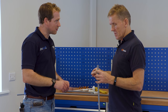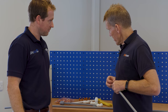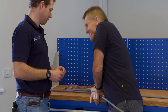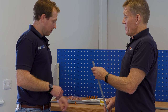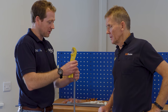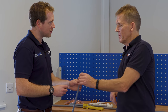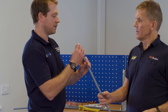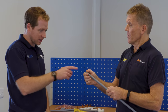Supposing I did use some cutters and I made the pipe oval — what do I do then? Well, the first thing you'd do is insert the liner into the pipe. What I'm saying is — for some reason that's happened to the end of my pipe. Well, ideally I would cut slightly further down the pipe and remake the cut, put the insert in and then you're good to make a nice secure joint. But if you put the insert in anyway, you can see it's formed it back into a circle — it's good enough. So as long as that liner goes in, we're back to square one.